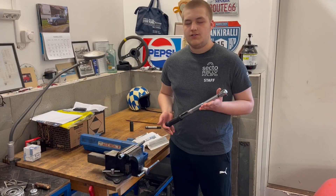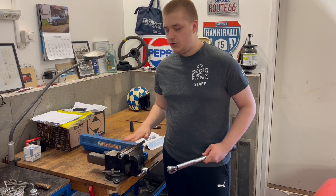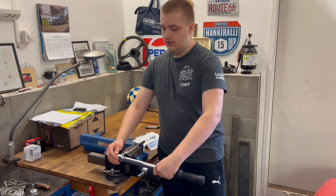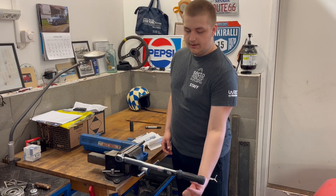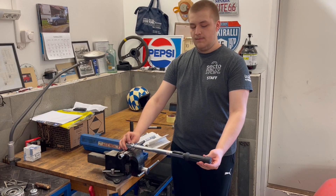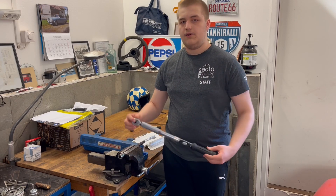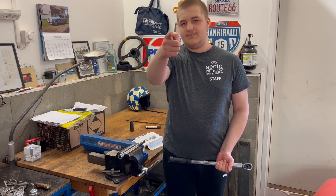The calibration report shows the actual readings of the torque wrench. Now I'll briefly show you two ways. For both of these it should be good to have a vice — you attach the torque wrench like this, then attach weight to the handle and see what reading it clicks at. The other method is to attach it horizontally and pull with a fish scale or luggage scale, and test whatever reading it clicks at.